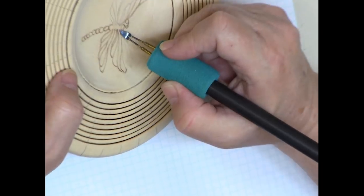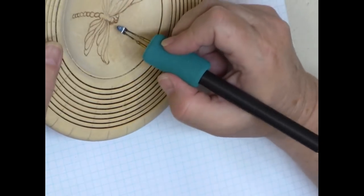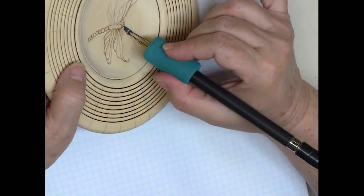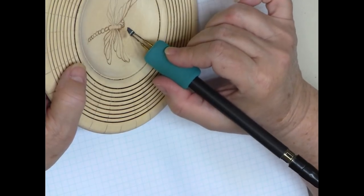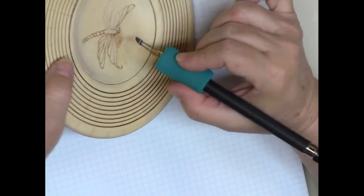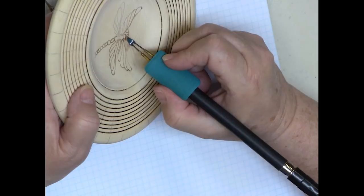I want to test again to make sure it's not too dark. You can't just go and burn it dark all at once — if you did you'd get blotchy. You have to work up to it. I like to start in a corner, right on the tip, real close in there. Out in the open area I just do little circles, staying on the flat and trying hard not to let one side dig in.